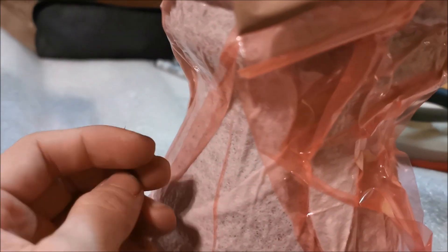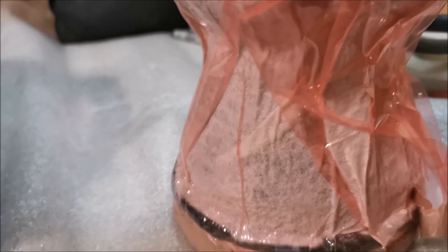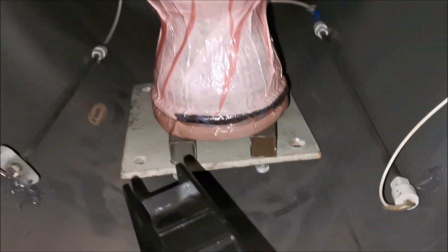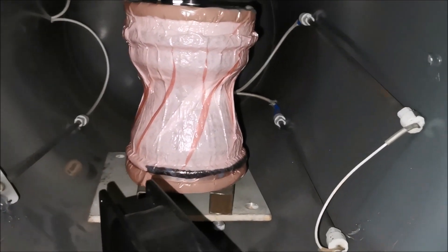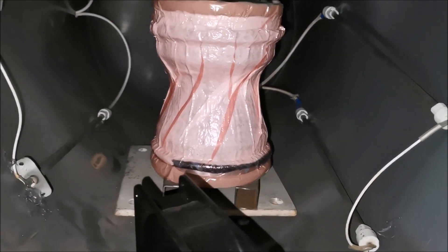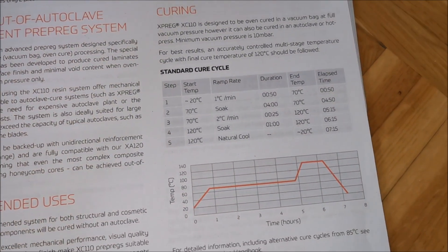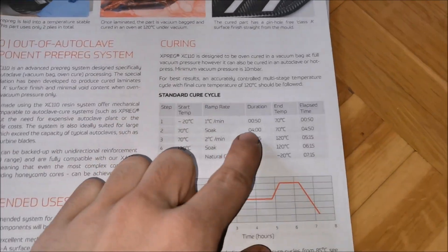The vacuum pump is off and the connector is out. You should not be able to hear the foil when you're not touching it — if you hear it, the vacuum is losing and the foil is returning to its position, meaning there's a leak. I've now placed the mold inside the oven on a bracket, centered between the heating rods. The curing cycle starts at 70 degrees and soaks for 4 hours.